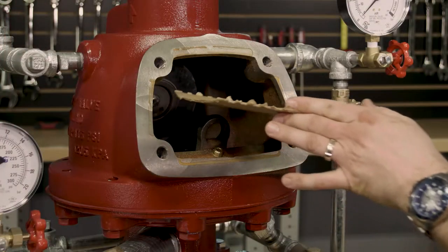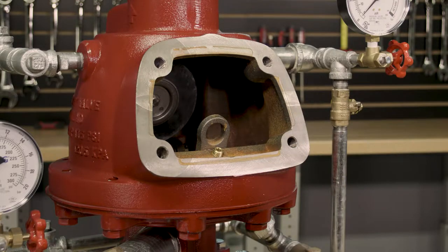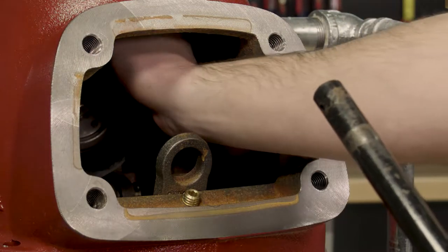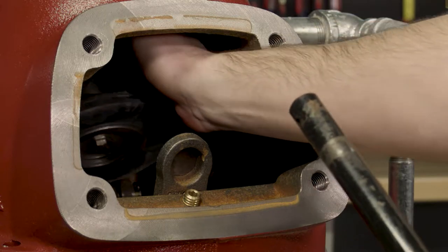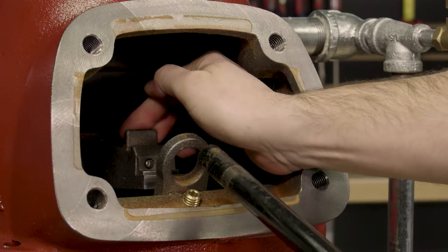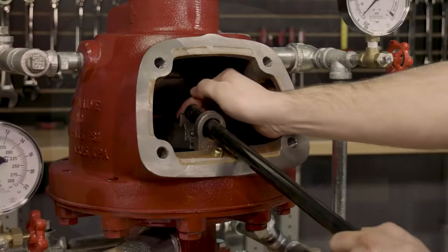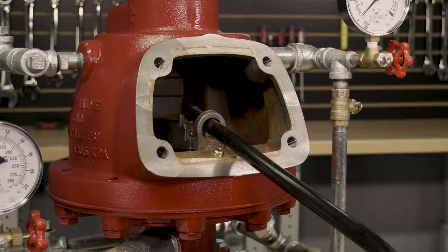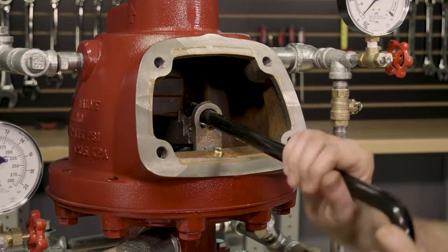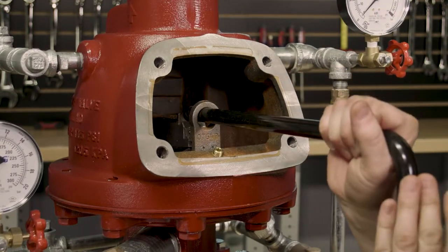We will want to remove whatever we placed inside the valve to cover the water and the air seat. At this point, we can now reset the clapper on the dry valve. Using our thumb and pushing up on the latch, we will pull down the spring-loaded clapper assembly. We can then insert the dry valve reset tool through the hole in the hook assembly until it hits the stop on the clapper arm. Now with a sharp, quick upward force, we will pull the hook assembly up over the top of the clapper arm.